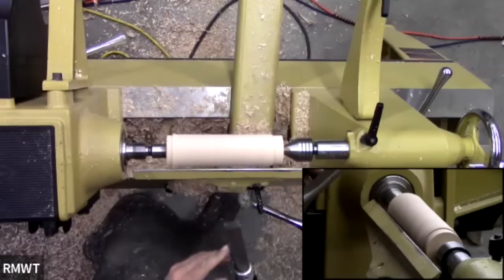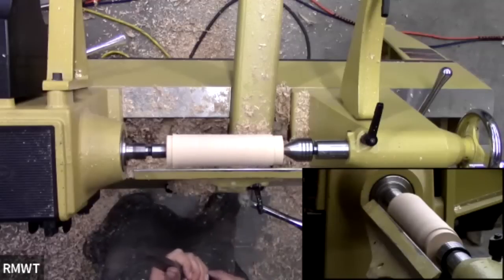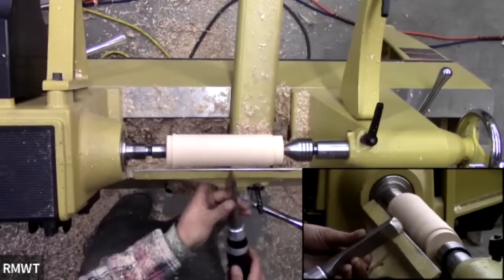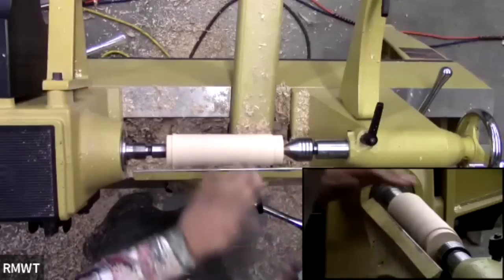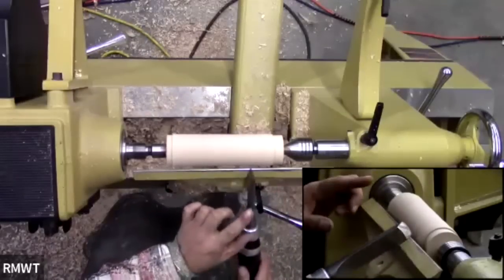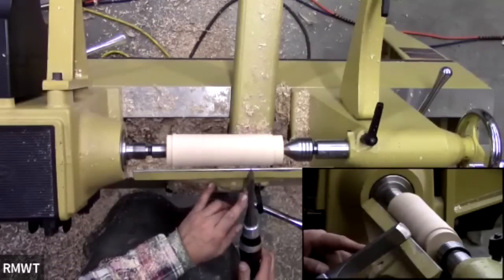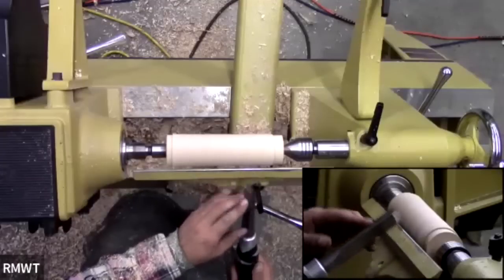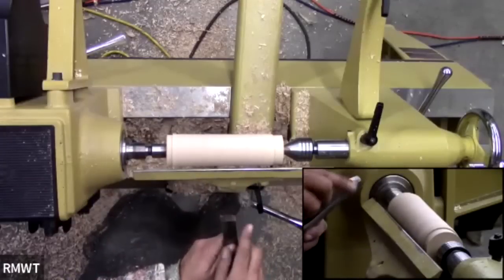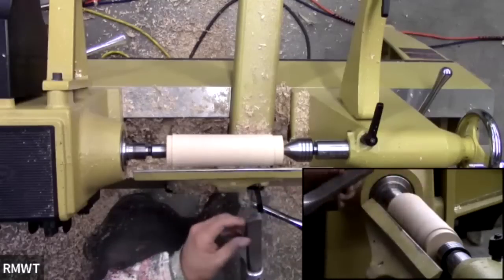a need for greater balance within the body mechanics used to create it, whether I'm going to the right or to the left. So instead of making some tiny little thing like this, I'll show you what I mean by this in contrast. If I just lead with, one thing to rewind a bit, if I'm making a bead and I'm starting with a V groove, I'm not ever going to be using the short point of the tool or the heel. I'm always going to be leading with the long point or the toe. Okay.